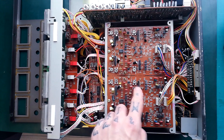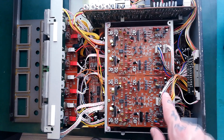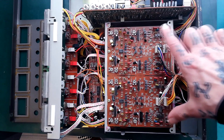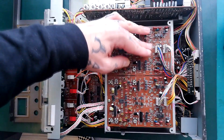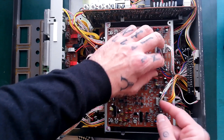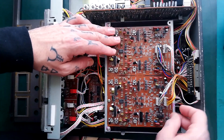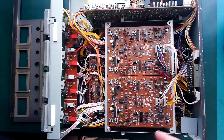Here we've got the DBX boards — I know that because these chips say DBX on them and I can read. From the point of view of reassembly, it would be possible to get this pair of cables mixed up and this pair mixed up, because they've both got 5-pin and 6-pin KK Molex connectors. Note that the left post is distinctive because it's got a solid red, black and blue cable, whereas these are all white and striped cables on the right. Of these, it's orange and yellow ribbon cables on the right, whereas it's white and grey ribbon cables on the left.